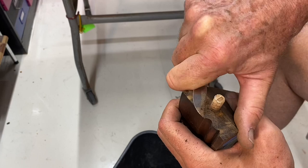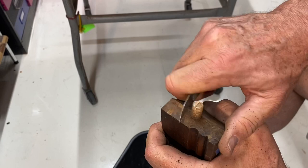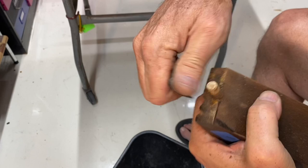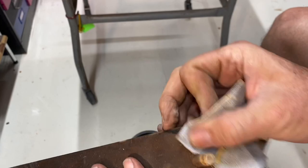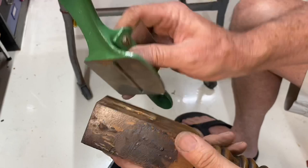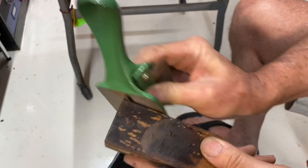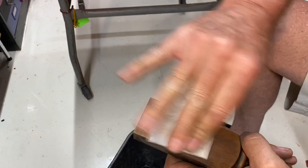I need to make sure I've got good wood-to-wood surface to glue. Nothing glamorous about this — just scraping all that old stuff out. It's pretty dry so it comes out fairly easily. Got to get the glue off the dowel too, then a little sandpaper and it feels pretty smooth. This finish is very, very dry and the glue is long since giving up the ghost. The legs will have a bit of high glue left from the original glue-up; I'm just using a scraper to get the high spots off, then 120-grit sandpaper gets it pretty much back down to the wood.